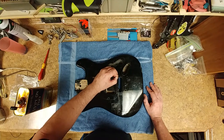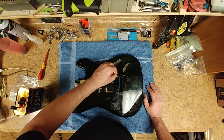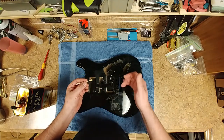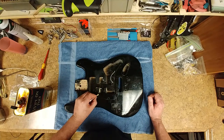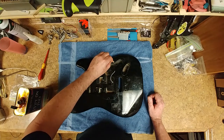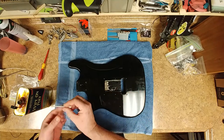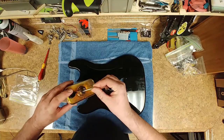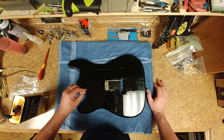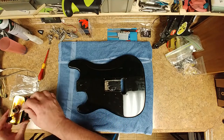Using a Q-tip is like a sponge - it's going to absorb a lot of the rub-on poly and it'll be easier for it to soak in rather than flooding the wood. I only have to do this one time because the amount I've put inside is quite a bit. Rub-on poly takes about eight minutes to become tacky and about a half hour to be dry to the touch. I'm also going to do this area here and around this area including the strap lock holes.